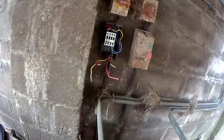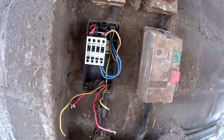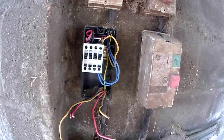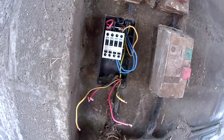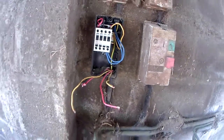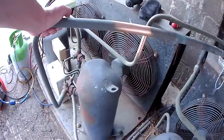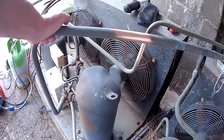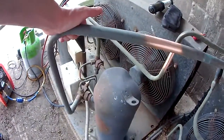Just taking the wiring out of there. We've got to upgrade that a bit because the new compressor is a little bit bigger — that's borderline on what they're running. It's a 4mm cable. I think these old ones run around 25 amps max and the new ones are rated for about 35, although I don't think they ever pull anywhere near 35 amps, but you've got to put stuff in to suit.